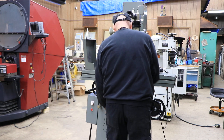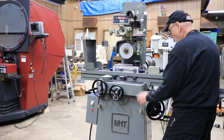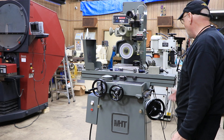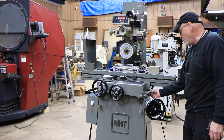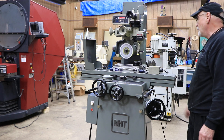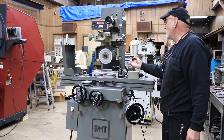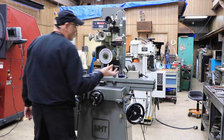You've got dials here on both your vertical and your saddle — you can set your dial so you know where to go down. You've got a lock mechanism on the side, a bar that you can lock this table into place so you don't accidentally bump it and move it, especially when you're moving this. Moving this has no effect on this.